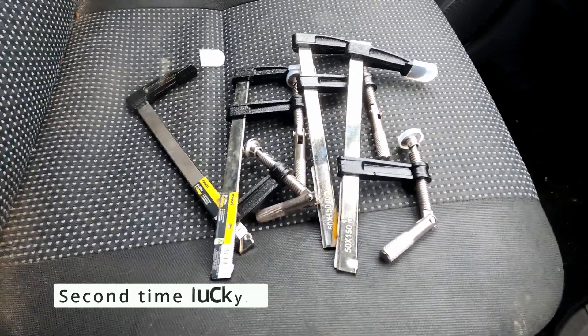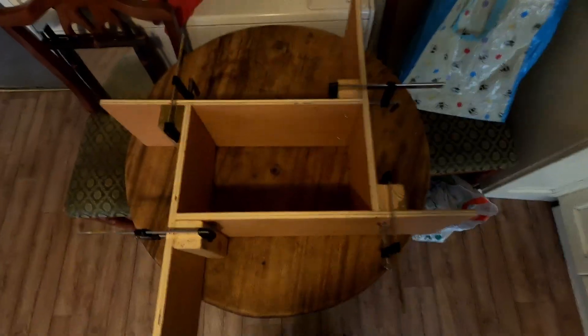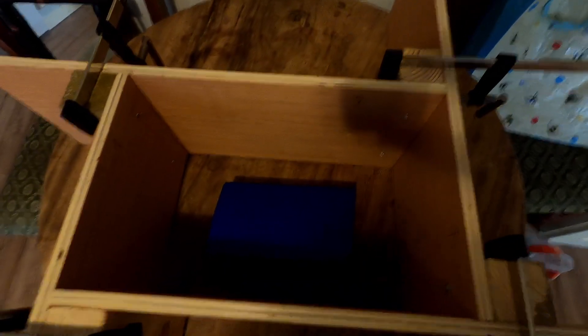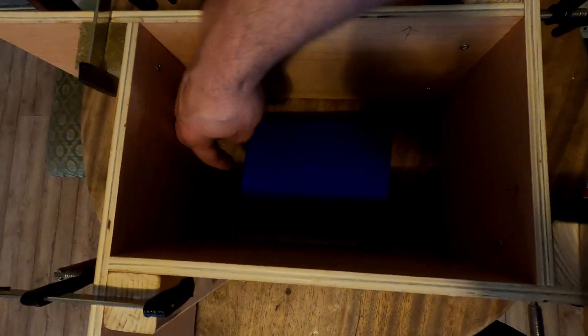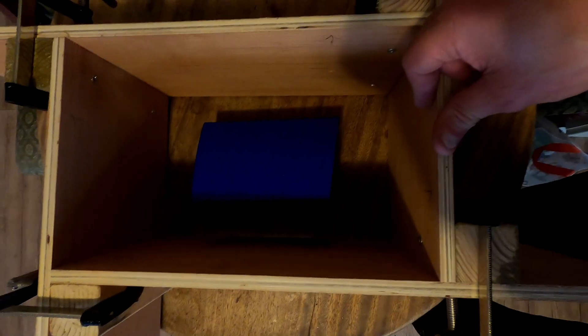Four traditional F-clamps — just what I need. With the clamps on, it now looks like this and I have set it to a width and length that I think is good. I've left a little bit extra on one side because I'm going to make a little key there, so when I put the male and female moulds together before casting, I know they sit in the right position.